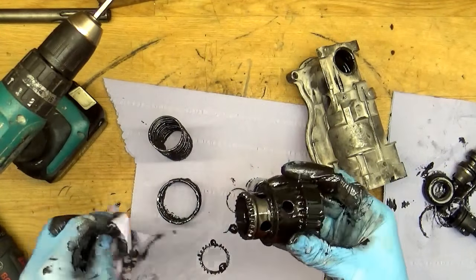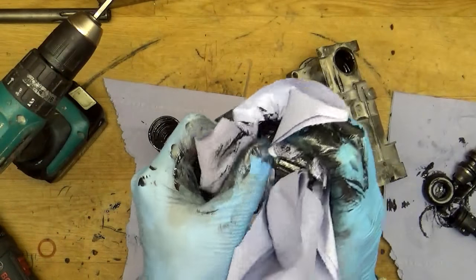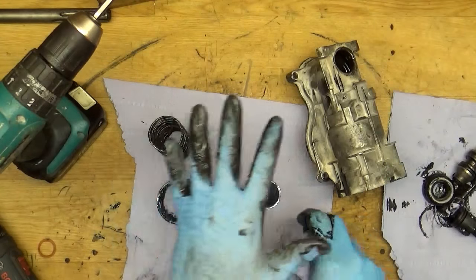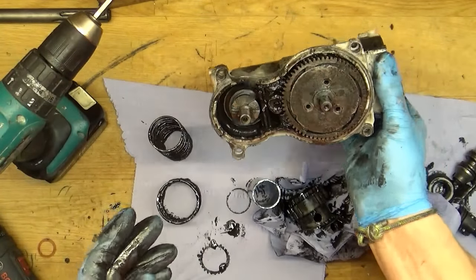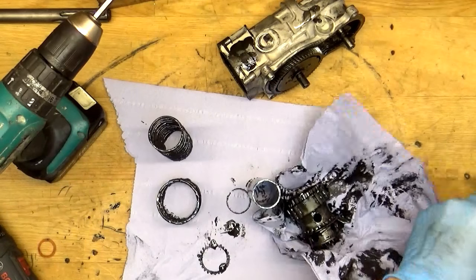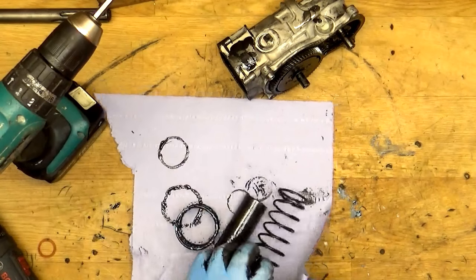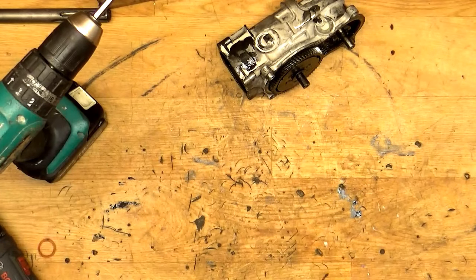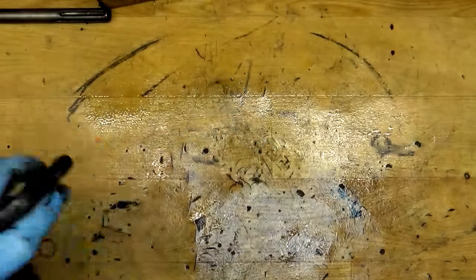About the gears — normally they are healthy and they are good now. So we need to clean it and the gears inside are good. The clutch here is good. So for this one we need new O-rings, we need the armature winding, then we need a tool holder — that's the most expensive part — and of course new oil. I will put a link in the description for the oil for the Hilti. I'm shipping that oil to all of Europe — it's really not expensive compared to the genuine oil, and it holds the same load and durability.